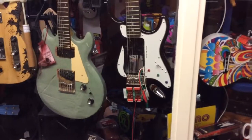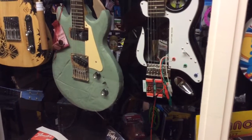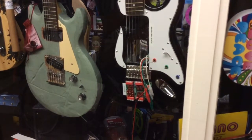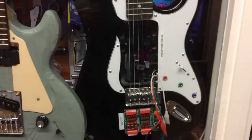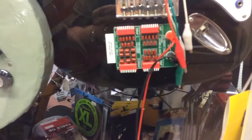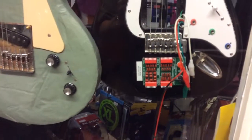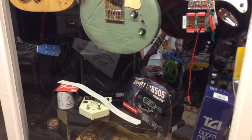That is my special guitar that I use for testing. You're wondering why it's got a big hole in the front. Well, when you come in and I've got these lovely hand-wound pickups from a company called Alchemy — we stock them — I can put them in the guitar and we can work out where your pickup is on your guitar, put it in the same place, and you get to hear what it sounds like. Then we can custom design a tone control using various capacitors to get a nice warm bluesy sound, and we've got a whole drawer full of inductors to make scooped or peaky tones.